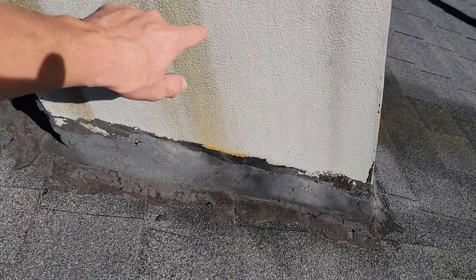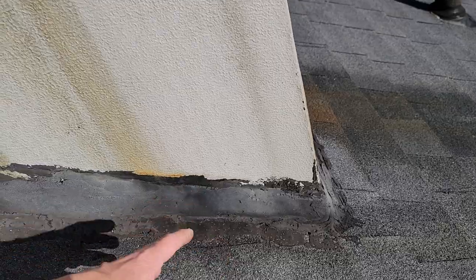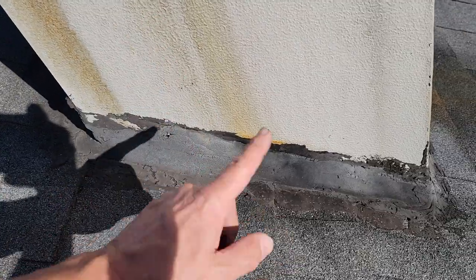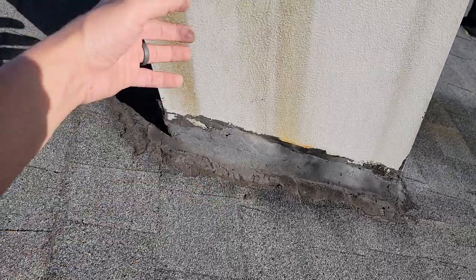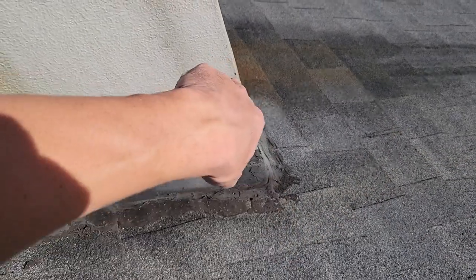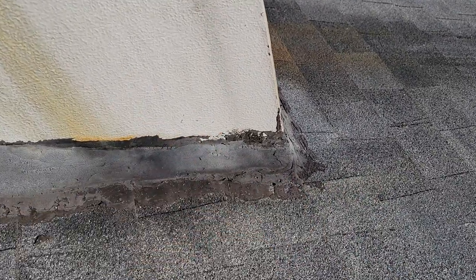There's not much flashing with this chimney style — no three-piece or four-piece flashing kit. Typically you see a U-shaped flashing on the bottom that's crimped up, a top that crimps up, and they overlap each other in the direction the water is going to flow, and then your actual chimney sits down over the top. When you take these loose instead of screwing or nailing through those little flanges on the high and low side, bend a piece of flashing up under it coming up plenty high. Use something rigid — thick gauge steel, thick gauge aluminum, something.